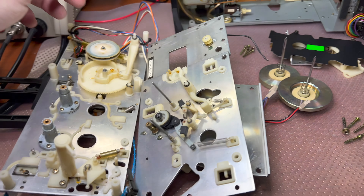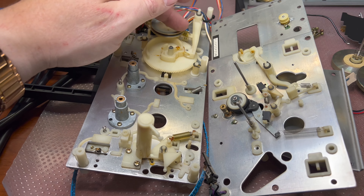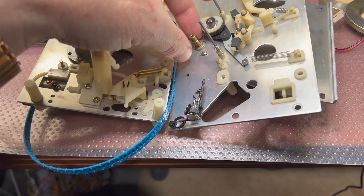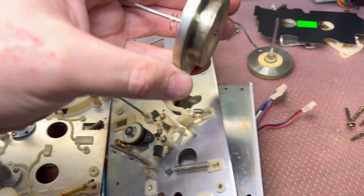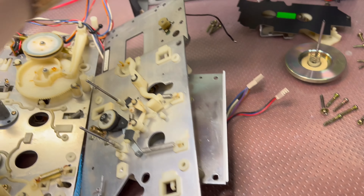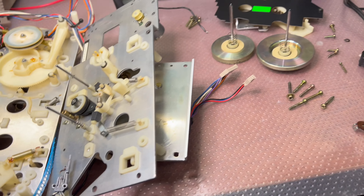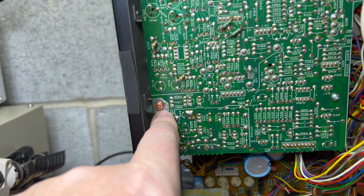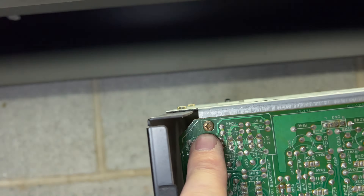This is the common motor which rotates the common gear driving the tape transport. There is a capstan motor and a reel motor. Old belt residue was not cleaned properly, so I'll do my best to clean it from both capstans. It was serviced very poorly — multiple screws are non-original, and even a copper plate here is a replacement, not the original. There are multiple mess-ups with this deck; I hope I can make it running.